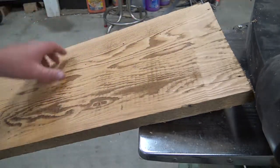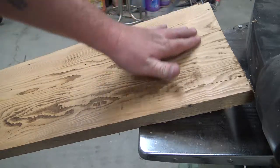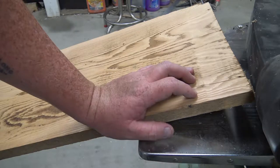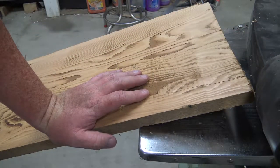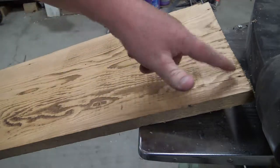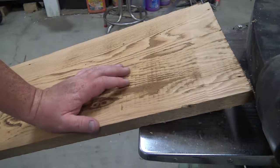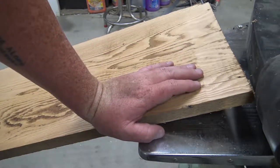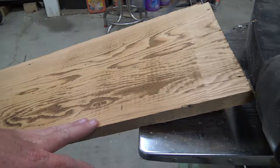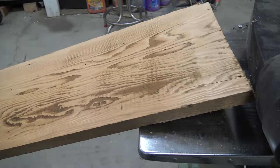That last pass was pretty difficult. I didn't like that one. Typical DeWalt planer — my dad has the exact same one. I remember growing up with that planer; anytime we planed anything, right at the end where it pops out, it always cuts more into the last couple inches. There are nail holes on this end — I'll likely cut this piece off anyway. There's a crack there too. I'm going to flip it around so the other end comes out instead, since the other end doesn't have that issue. We're pretty much cutting the entire width of the plank now, so I'm going to do a 128th of an inch with each pass.